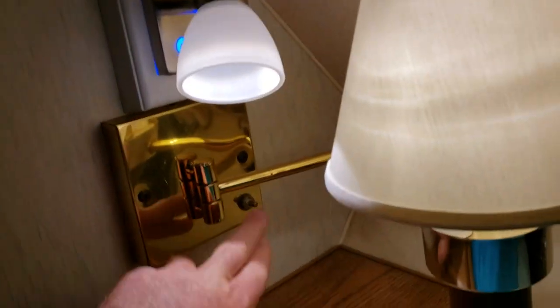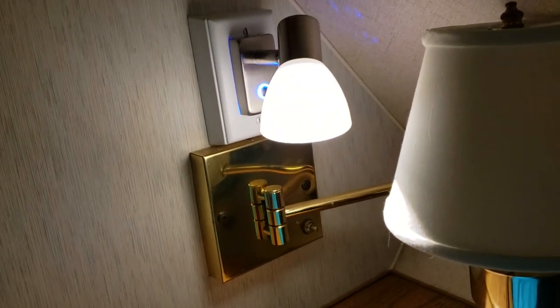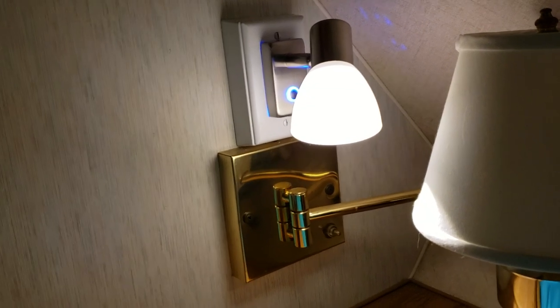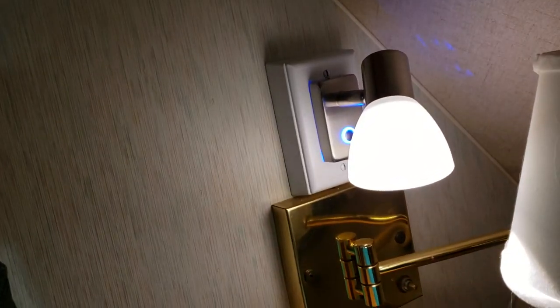That's the original light if you need extra light. The USB ports are on the opposite side to charge your tablet or your phone. I used an off-the-wall box here because we're coming out of a wall, not behind a cabinet — that's why we use that box.